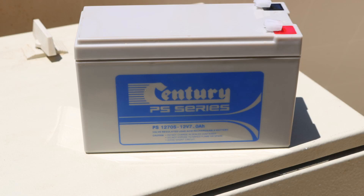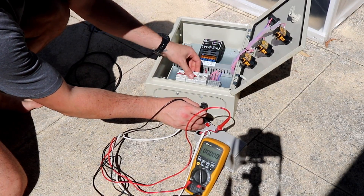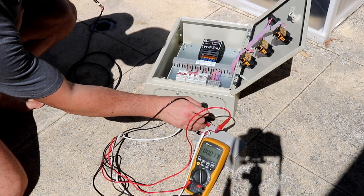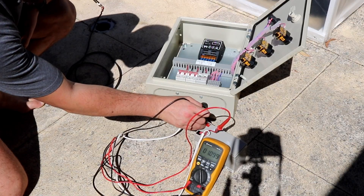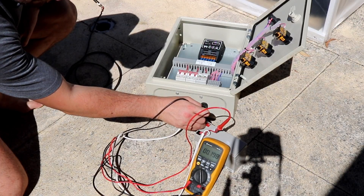This is the battery — it's a lead acid rechargeable, rated at seven amp hours, meaning it should theoretically be able to supply seven amps for one hour or one amp for seven hours. I'm using my multimeter to measure the current draw on the battery and in standby it's about 150 milliamps. Once I connect the solar panel in, you can see it's trying to charge the battery — the maximum I saw was about 1.5 to 2 amps, so that's pretty good.